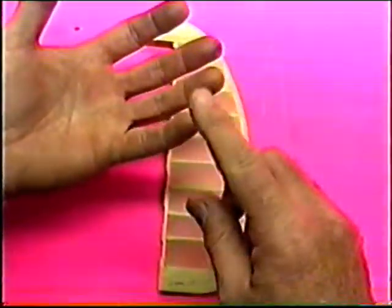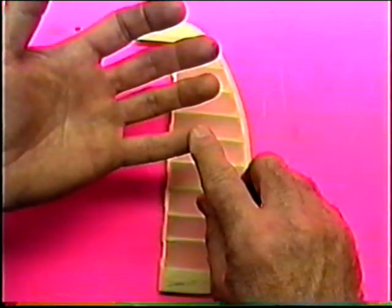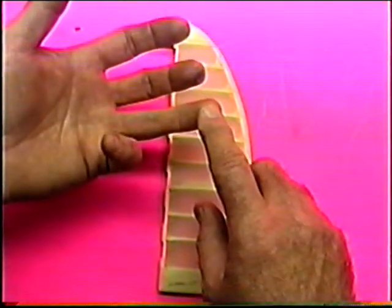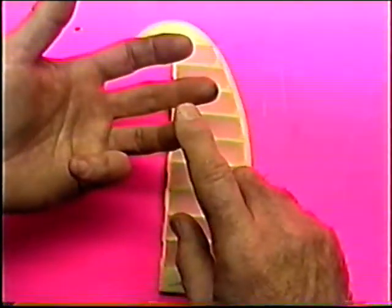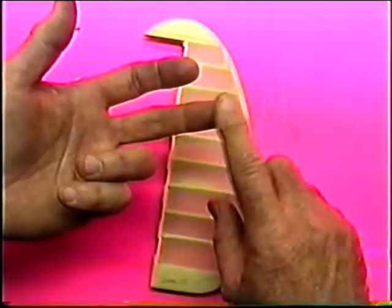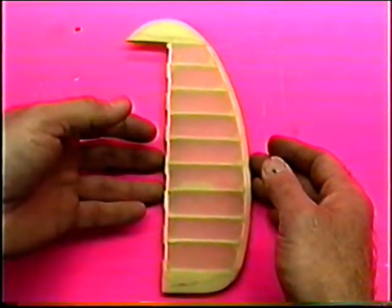The silver serves two purposes. It fills in little flaws, microscopic flaws, but you really don't want to use it like primer. If you have giant flaws, you want to use primer. Or if you're trying to fill grain, you want to use primer. But what you really want to do is use the silver to find your mistakes, and you'll see very soon when we paint this part and the main frame, you're probably going to be pretty disgusted.